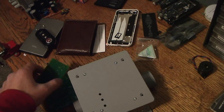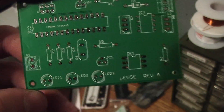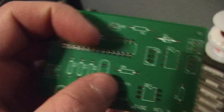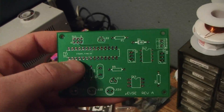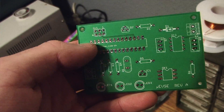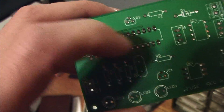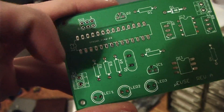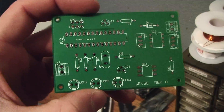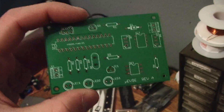I even went as far as to make a professional PCB — I actually had one of these made myself in Eagle. I named it Micro EVSE Rev-A. It's the entire thing without a separate Arduino board — it has the ATmega328 right on the board, the same microcontroller as the Arduino Uno. Everything you could possibly need fits on this board: detecting the pilot signal, sending signals to the pilot, monitoring all states. This is the full-blown board.